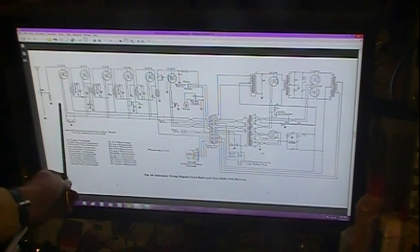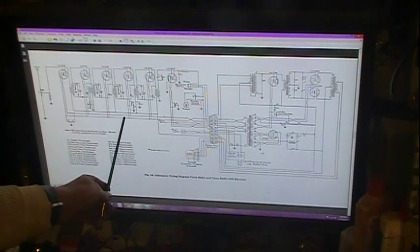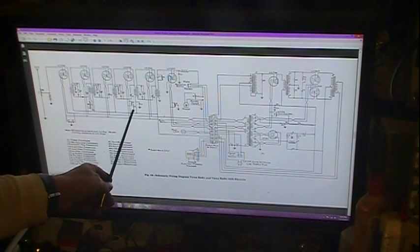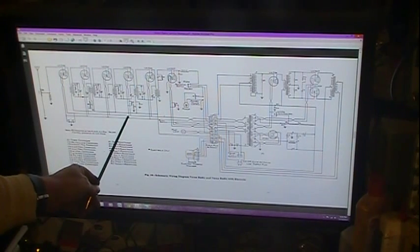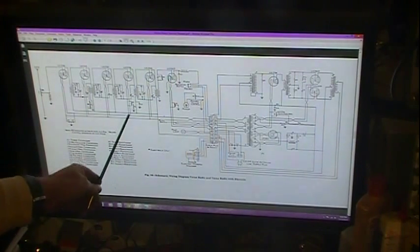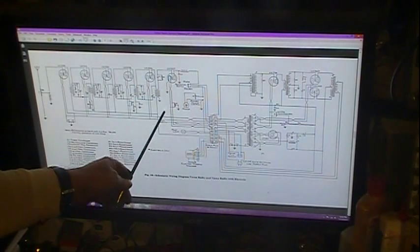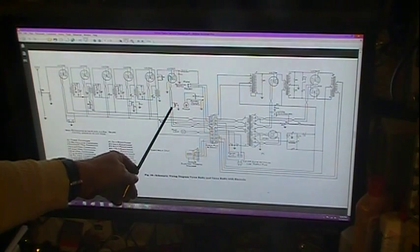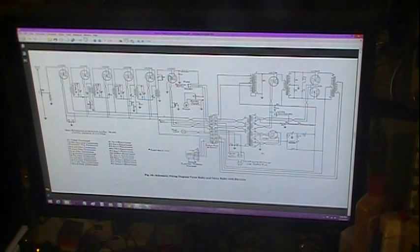And the other thing I want you to notice, somewhere in this line, there it is, R1 and R3. These guys are actually self-biased by their own biasing resistor, which is R3, 400 ohms, R1, 20 ohms, right there. The resistance on this hum control and this hum control is also 20 ohms across it. And of course there's the pilot light and so on.